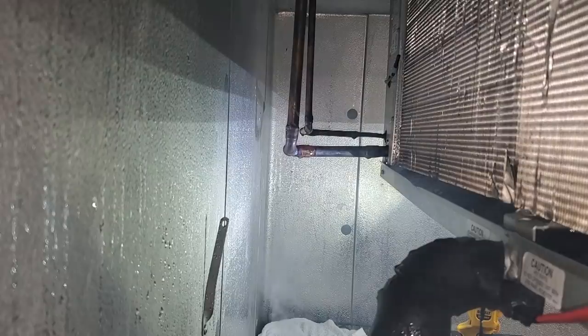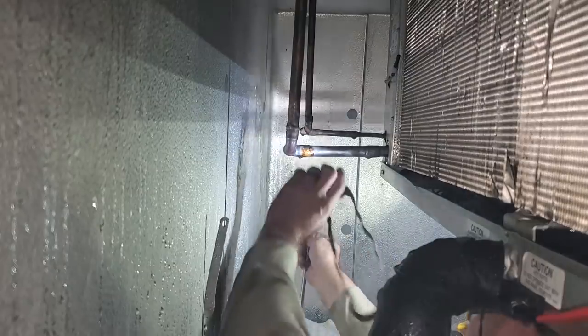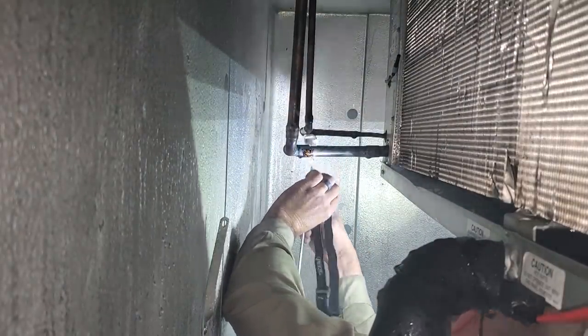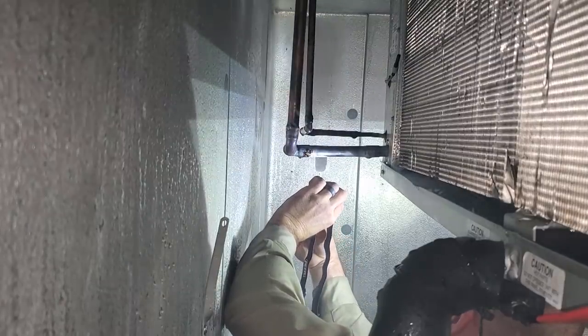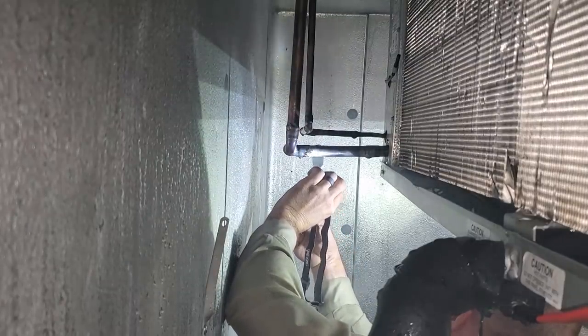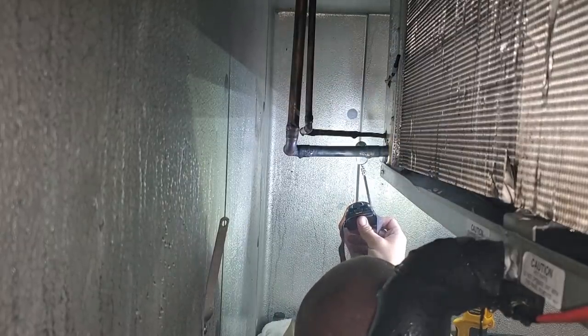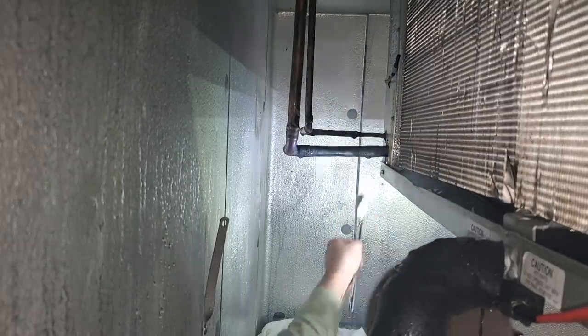Okay, there's definitely more than enough solder on there. I tend to go a little heavy, especially when I'm working on a joint like this that's becoming problematic. I'm hoping we didn't get any oil contamination. It's one of those things you just gotta learn to work with. We're gonna inspect this joint, make sure we had even flow. Looks good. And you see how when I braze those, I pool the solder on the top and then I let it drip down. Yeah, we got plenty of solder. Looks like it got in the joint nice and good.